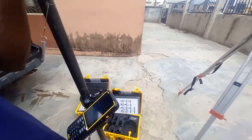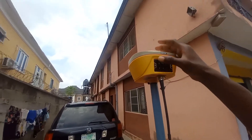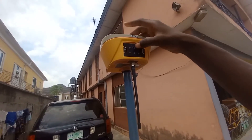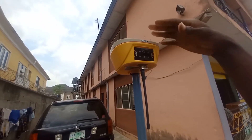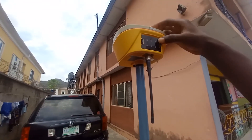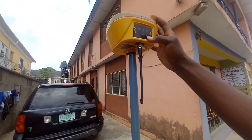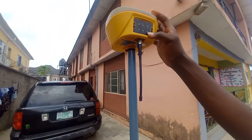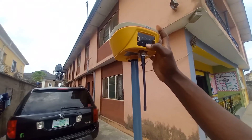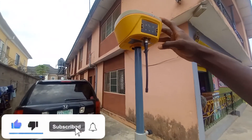The next thing is to connect your instrument. First, turn on your base. Before turning on, let me show you this screen: this is the satellite light indicator, showing when the satellite is functioning. Here is the data transmitter indicator, showing that the instrument is transmitting data between the GPS and the data logger. This one is for static observation, this one is for battery — it shows green when charged and blinks red when low. This is for Bluetooth. Now let's turn it on — you can see the instrument has come up with the green battery light.